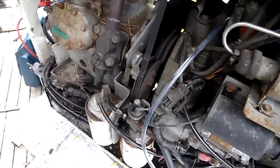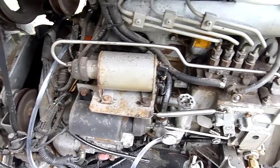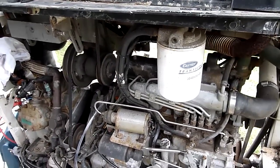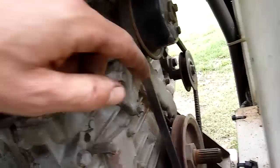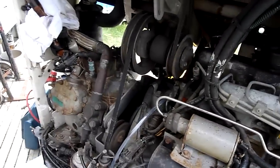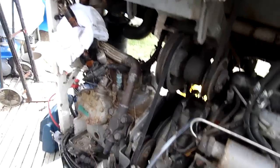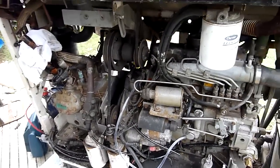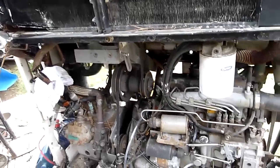Anyway, that's your little fill for now. I've got disassembly work to do next — that'll probably be next weekend. Full autopsy: a full teardown of the whole shebang, get the compressor and engine off in one piece afterwards. It looks like the water pump's been leaking a bit at one point, but that's to be expected — it's pretty old. I'd say this thing's done a lot of hours and they just couldn't justify rebuilding it, maybe because of a refrigerant leak. R-22 has basically gone the way of the dinosaurs. It's a bit of a mess, so good scrap metal value — all aluminium and copper alloy coils. Thanks for watching.